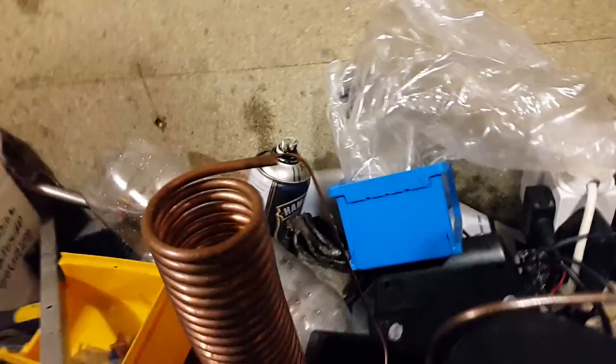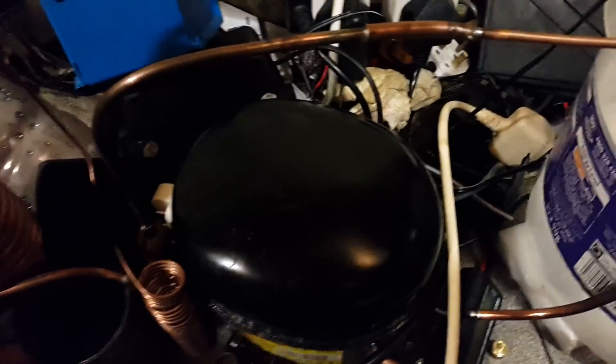I can only charge by sound just now because I don't have any gauges. I'm going to place the camera down on top of the compressor so you can get an idea of the sound of what's happening. This is just me adding the refrigerant, so that's what the hissing will be. Now it's beginning to make that characteristic noise you sometimes hear your freezer making - I reckon that's just the propane boiling off in the evaporator.